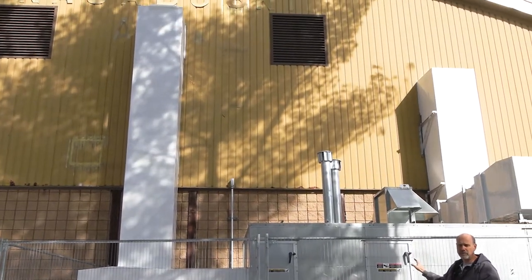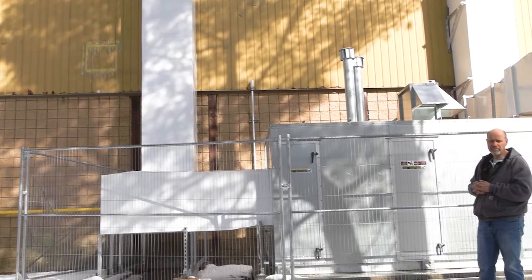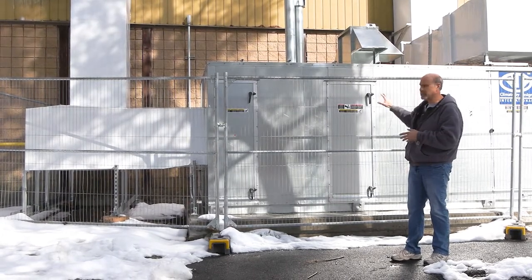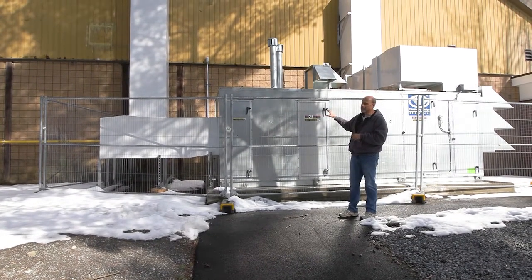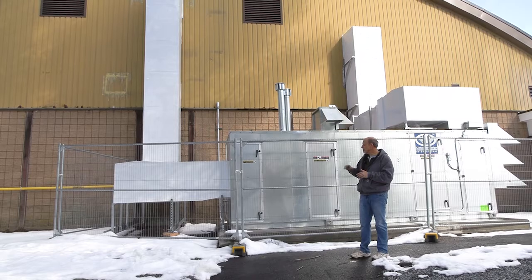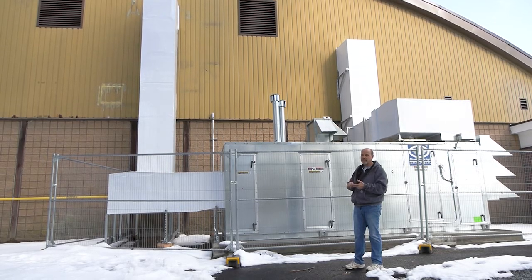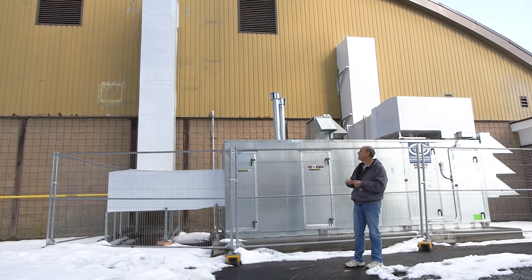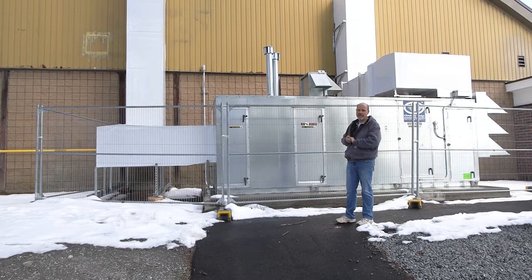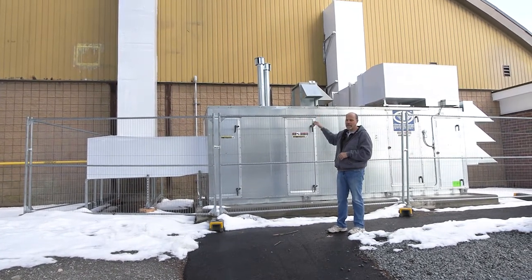We already did a training session on this unit with the factory start-up technician, Adam, Dan Roy from Valley Associates, Patrick Sewell from DCR, and myself. This system maintains the entire rink and is connected to the building automation system. It can raise and lower set points for humidity, dew point, and temperature in the rink, and monitors CO and NO levels. There is maintenance required on this — it's one of the most sophisticated components other than the chiller plant running the climate control in the rink.